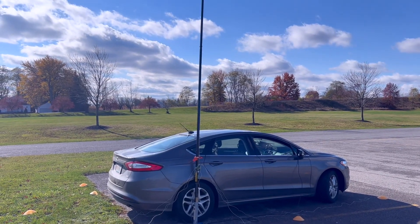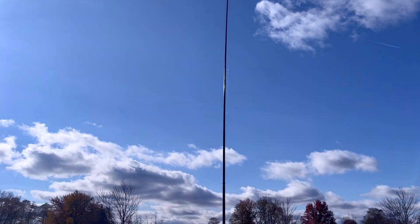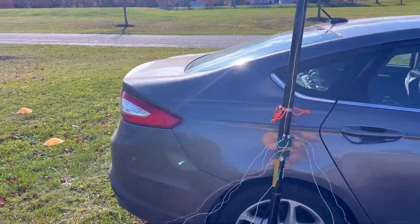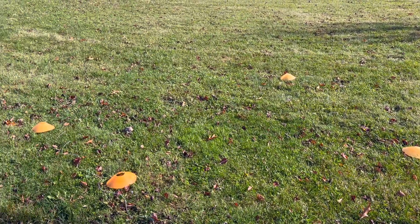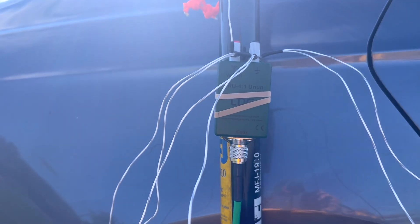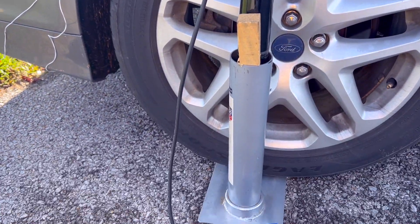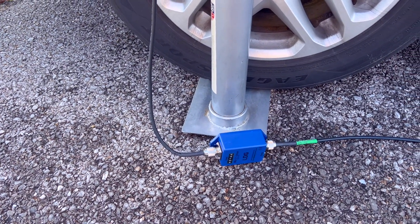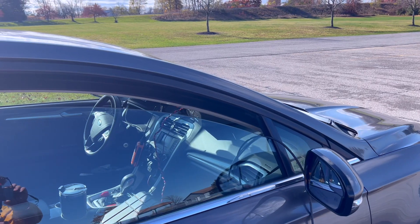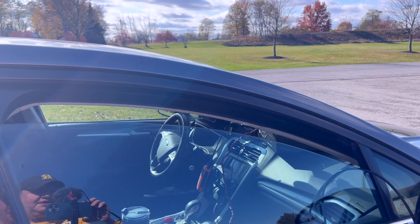Let's take a quick look at the setup here. The Rybakov uses a 25-foot radiating element going up the 33-foot MFJ mast, and for radials I have six 17-foot radials going off in different directions — they're marked with cones. All the wires are connected into the LDG 4-to-1 balun, and I'm using a bongo tie to secure that to the mast. Then I have a short jumper of coax going down to the LDG 1-to-1 choke, then about 15 feet of coax going from the choke to the LDG tuner, and then that's connected to the ICOM 7300. It'll let us run the full 100 watts with the Rybakov.